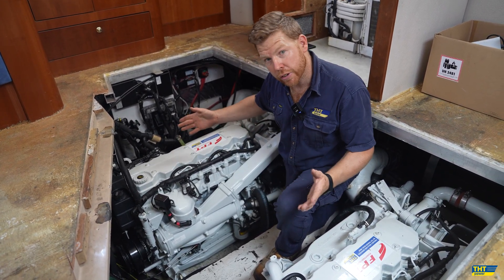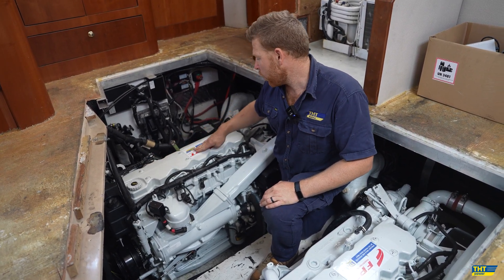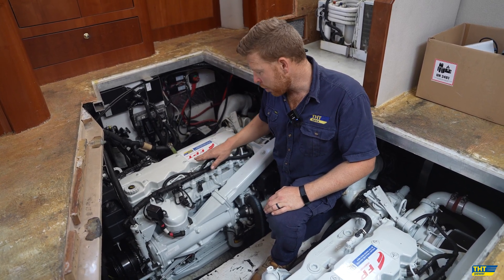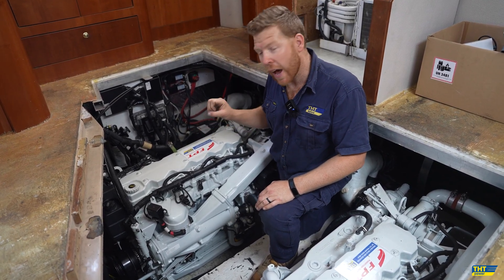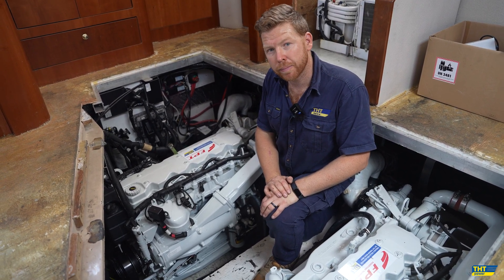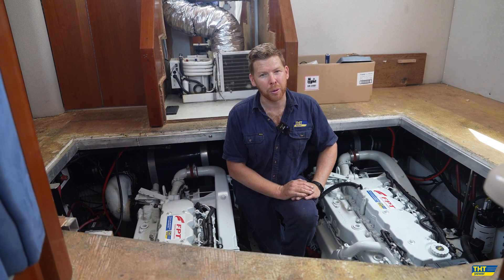From there, there are six individual lines — in the case of the NEF 6.7 engine with six cylinders — each going to an electronic injector underneath the rocker cover, which pulses away. High pressure fuel is provided all the way to the injector, and it's the responsibility of the solenoids on the injectors to actively pulse that fuel into the cylinder as required on each stroke. Always make sure you're checking your fuel condition on a very regular basis to ensure your boating experiences are always enjoyable.